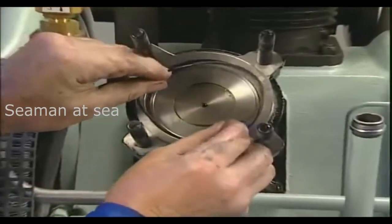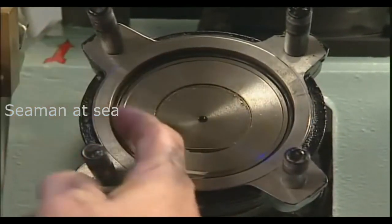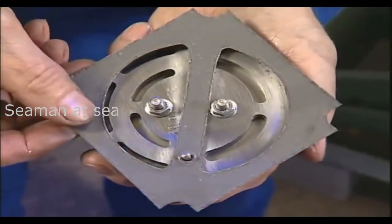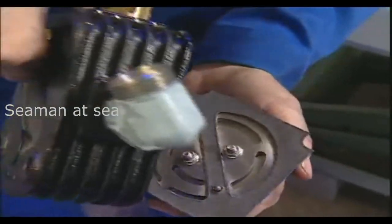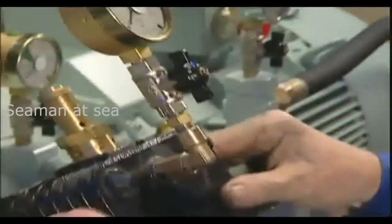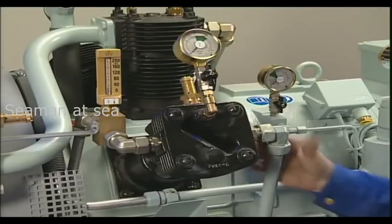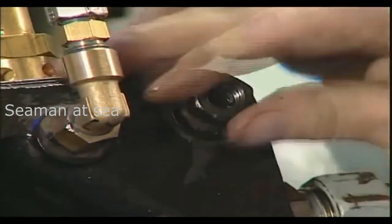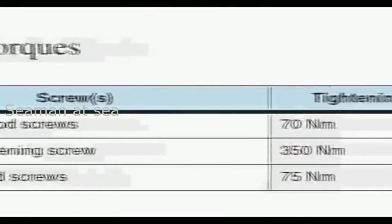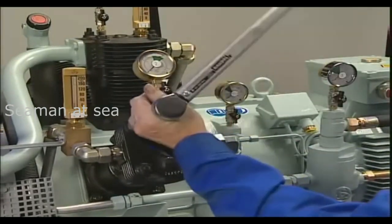Before the insertion of the new reed valve, a new O-ring has to be inserted into the upper part of the cylinder. During the installation of the gasket and valve in the cylinder head, it must be borne in mind that the drilled hole and cylinder pin locate and fit easily. Oil or a hot screw paste on the screw thread will make reassembly easier. When all gaskets and discs have been inserted and screws tightened hand-tight, the cylinder head screws are firmly tightened to 75 Nm according to Table Tightening Torques Chapter 8.4. The check for the piston rings is complete.